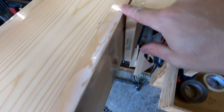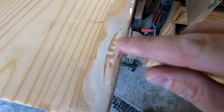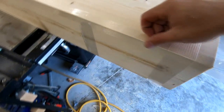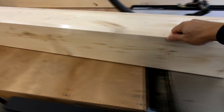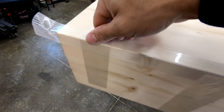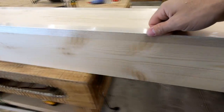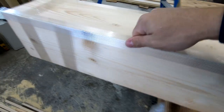I want to show the first beam where I over-glued it. Look at how much of that glue ended up coming through the tape — and now this tape is not even stuck anymore. With the packing tape I was applying more glue, but with the reinforced strapping tape I don't have any glue coming through. That's another big advantage: the strapping tape really just seals off the miter a lot better.